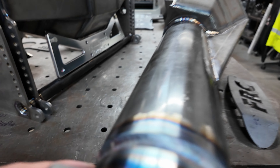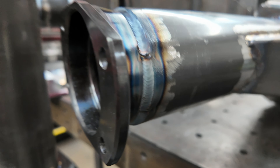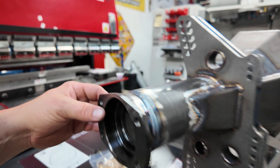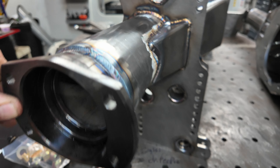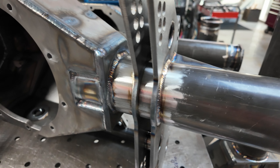All this heat that goes into the front edge works out really well — it just works out great to use that 3/8 on the exterior bulkhead and 3/16 on the interior. We just got done putting the ends on this one. They are impressive — it is hard to tell if there is any misalignment in them. They turn out so good. Here's some welding detail — this is what you can expect out of your TIG-welded housing if you get one.